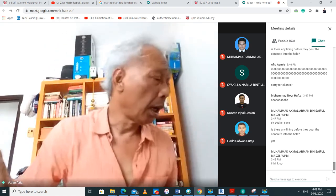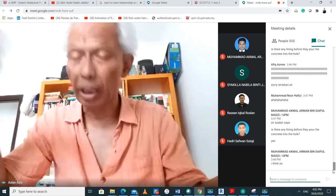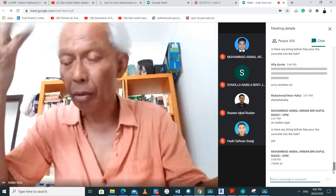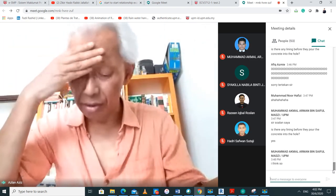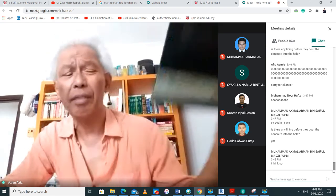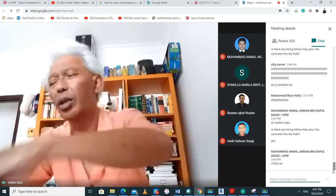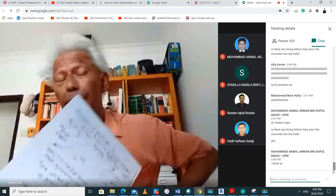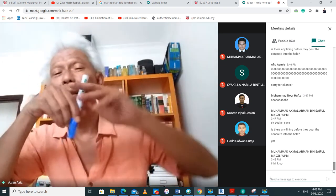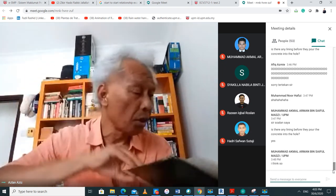What we need to realize is that tests are expensive. It should be considered for large projects only when you're doing this load test. Obviously, like I said, if you have 100 piles, you tend to test only 1 or 3%. But the results are not necessarily correct as many interpretations are available. It's a function of whether everything is correct, in other words, you did the test correctly, and your pile is not cracked, or when you are driving the pile, it doesn't break under the stresses you apply. If the pile is not broken, you will get a pretty easy interpretation.